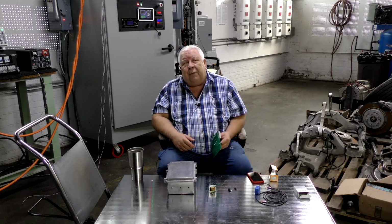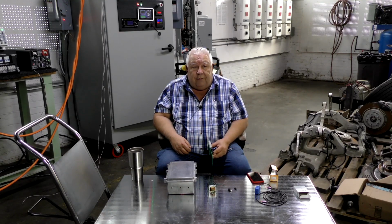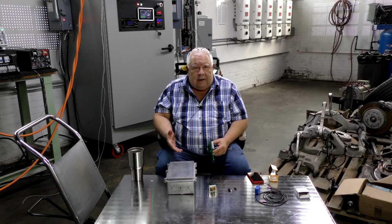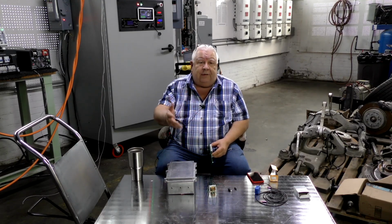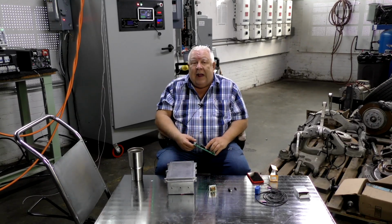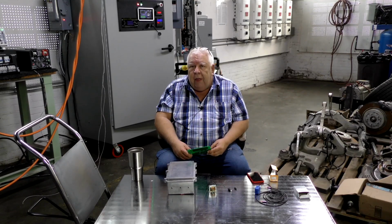And we kind of simulate a CAN bus by broadcasting that on the 255 subnet address, the last address of your typical 192.168.1, where your device is .110 or .120 or .140. .255 is reserved. You can't put a device on that. That is a broadcast address, and if you send something to that address, all devices on the network get it.